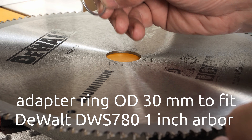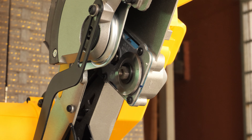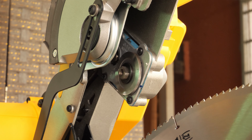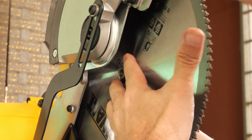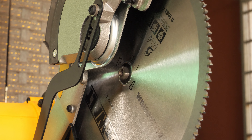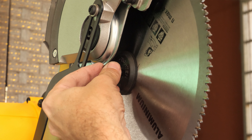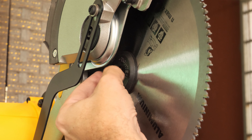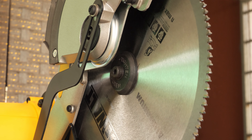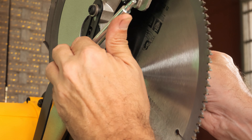I found the right inner ring to match the size of my arbor and I'm going to push it inside. Now that the inner ring is in, I'm going to place the blade inside. It's in, so now we can put back the arbor lock. Remember the direction of the teeth is pointing down because the direction of the cut pushes the stock towards the fence. To tighten it we have to turn it away from us using your left hand, then lift it up.